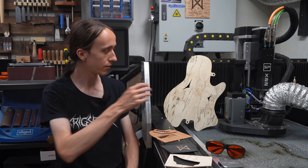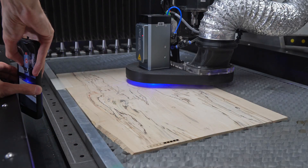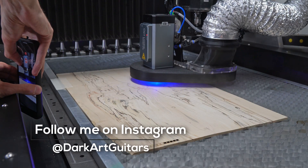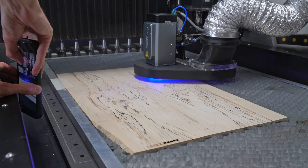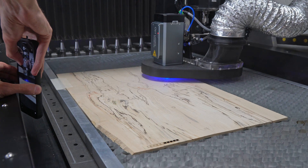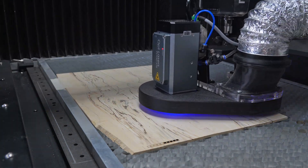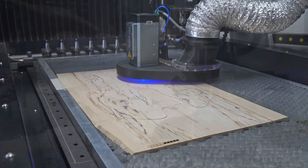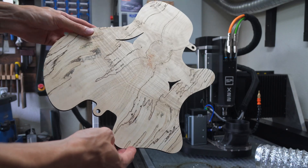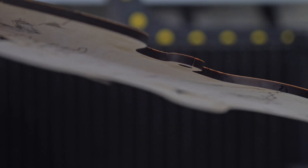Some examples of what I've cut: here is a guitar top, five millimeter thick box elder that's kind of similar to maple. I was running at about 700 millimeters a minute at full power in a single pass, and it cut through cleanly and perfectly. That is really fast for cutting. On most other laser cutters that I've reviewed, I would be going at maybe 200-300 millimeters a minute and doing multiple passes. By going a bit slower, you could easily cut thicker pieces as well.